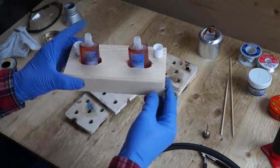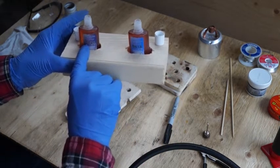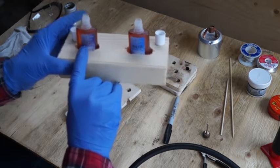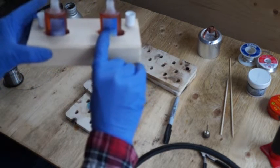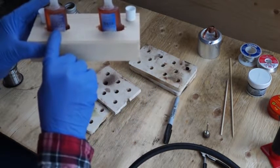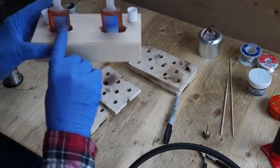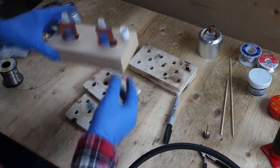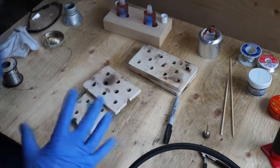They're from Russia and they're fluxes for soldering to aluminum. This one is FTKA — that's an F in Russian — and this one is F61A. The FTKA seems to be best for the job. It works at 180 degrees Celsius and the solder that I'm using melts at 183, so it's about right.